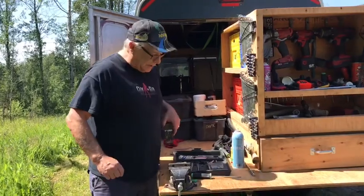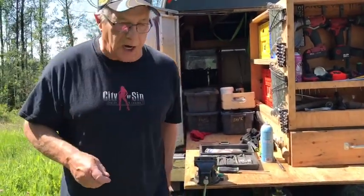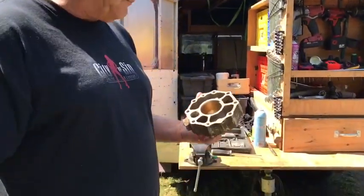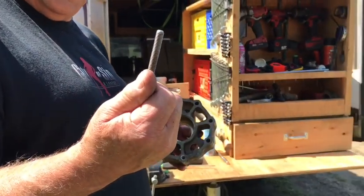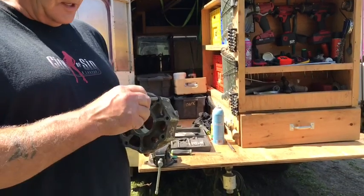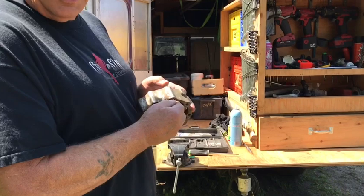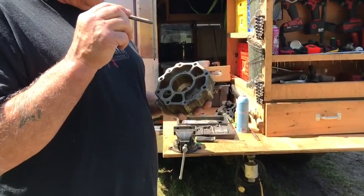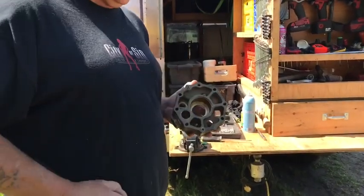Now what I did was, I just got a piece of junk out of Brad's garage because it worked really good. This is kind of funny. This is an old pump piece, right? But what happens is you got a 5/16 bolt in your bell housing or whatever, and it goes in and gets stripped out. Okay? So what Paul did was pretty ingenious. He put it through there and put a nut on it, which is all right. Now if you want to put the threads back in it, we're going to put the threads back in this housing so that you can put a 5/16.